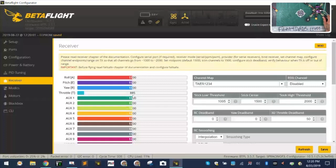I'm going to link my QX7. To bind the receiver, you're going to need to power up your quad. I'm going to turn the DC power off, make sure everything's off, then plug in your power. What you want to do is power up your quad and press the reset/bind button. There's a reset button right here — you have to have that pressed before you power on the quad. So first I'm going to go ahead and power up my QX7.